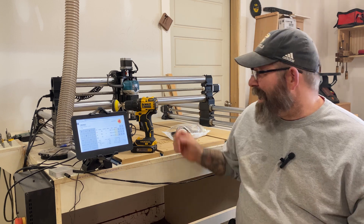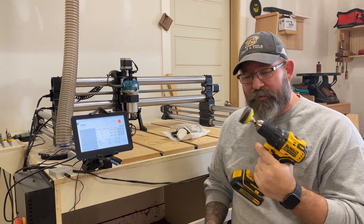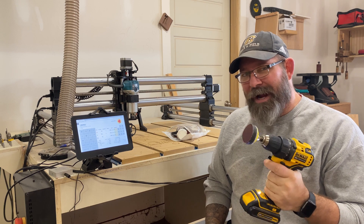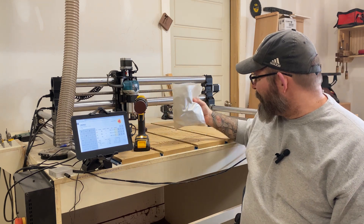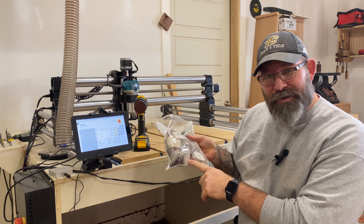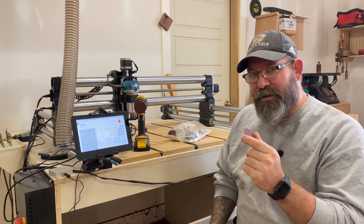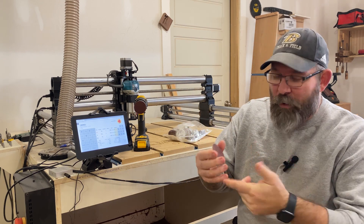I'm not going to mention things you'd already have in your shop, but I will talk about these sanding discs I found on Amazon — they've been a lifesaver. These are great for sanding in small areas, especially getting into the small pockets that you might create with your CNC. This particular package goes anywhere from 120 up to 2000 grit, with a variety of different sizes and several of each in here. Another thing I really liked is that if you need to get into some small intricate areas and just want to hand sand, you can fold these little discs in half and use them to really get into those nooks and crannies. I'll put those in the description as well.